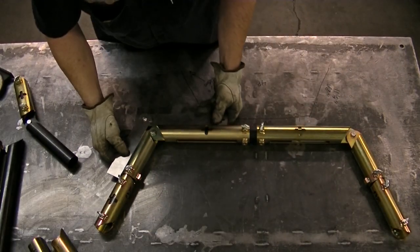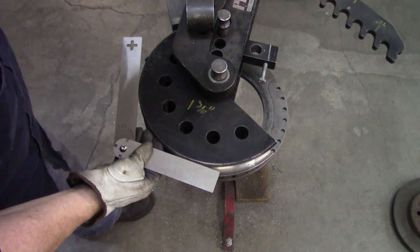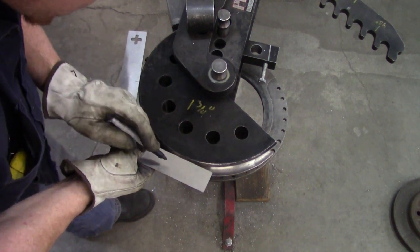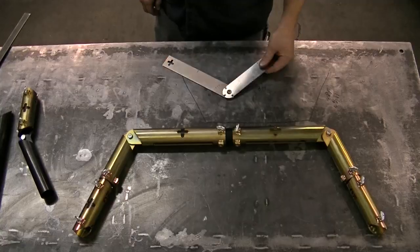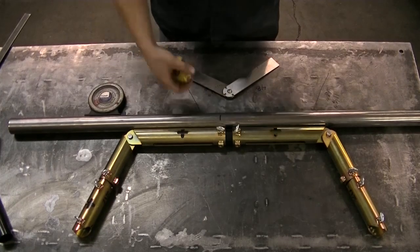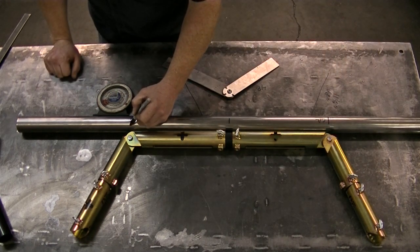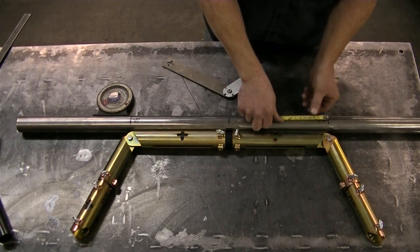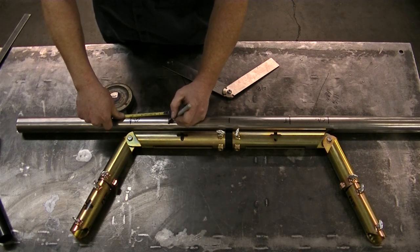Next I need to use an angle finder to figure out what the bend angle is. Then I can figure out the tangent point, or start of bend, by holding my angle finder against the die and marking wherever the two contact each other. This works because every die is the center line radius of the tube, so every contact point is the tangent or start of bend. I like to bend the easy way, bending from the center out. I'm going to measure the center line of the tube and line that up with the center of the jig, then mark the center line of each bend—pretty easy to eyeball since they're right next to each other. I can measure the tangent point from my mark to the inside center of the angle finder and transfer that to the tube. That number ended up being four and one eighth of an inch from tangent point to center line of bend.